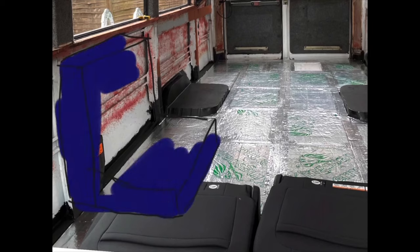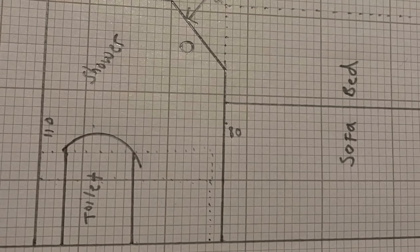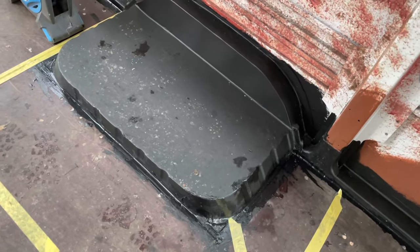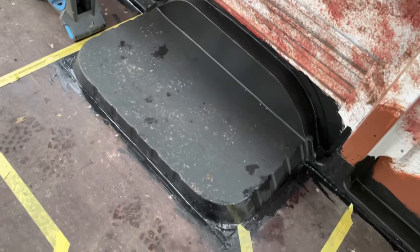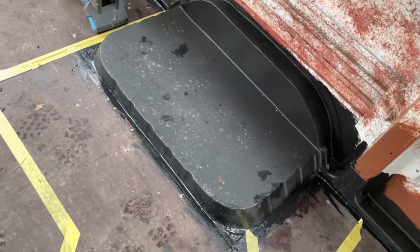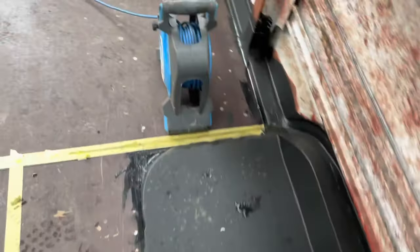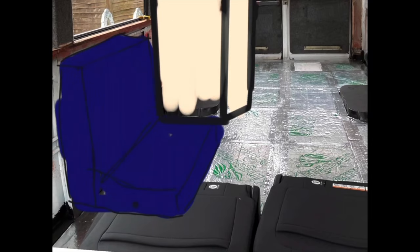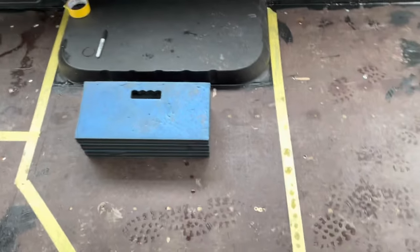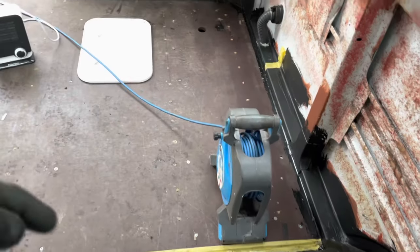On the other side there's room for a full-length sofa bed — 180 centimetres long by 65 centimetres wide, pulling out to about 1,100mm wide. We're going to walk down the gangway and then quadrant off the bathroom in the corner. There'll be a small step up of around 40 to 50mm. That little area will be like a landing, then you step up and walk into the bathroom which will have a shower and a toilet that pulls out into the shower area. On the front of the bed there will be drawers that pull out.